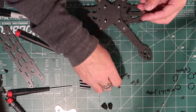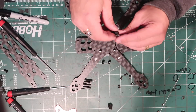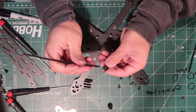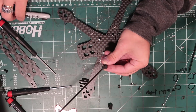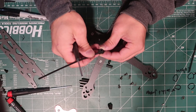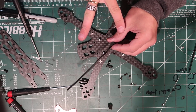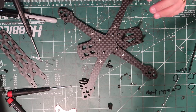There are two really short standoffs, and those go right here. The top of those standoffs are actually going to be your receiver antenna mounts, which is really cool. They give you tubes that go inside the little hole right here. You put in your antenna tube and as you screw down through here, it threads in and holds the antenna tube in place — which is really smart and works really well. I've actually tested this with Crossfire, and with the split-V coming out it works really well.